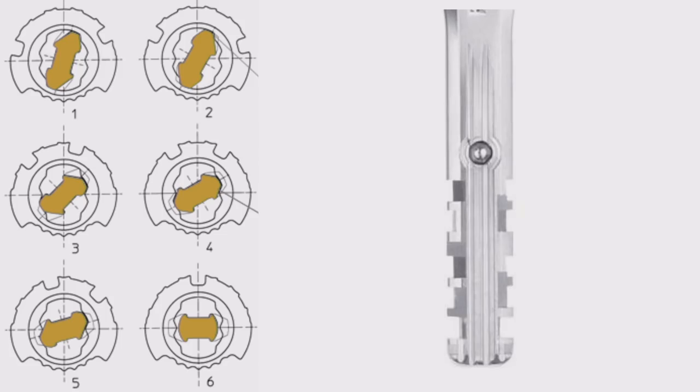And here you can just see, similar to how you would have different length pins for the bidding on a pin tumbler lock that would correspond to depths on a key, here you have disks with those notches, and depending on the radius and the angle of the cuts on the key, it'll hit it after rotating a certain amount. And those little notches on the outside at the top of each disk, those all need to be lined up perfectly for it to open.